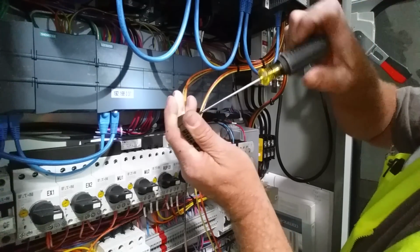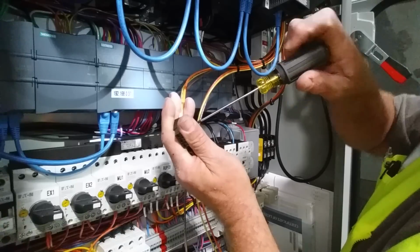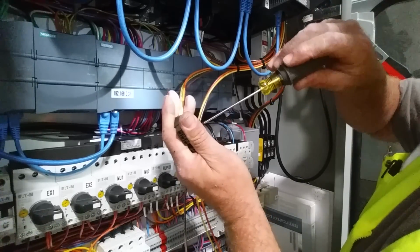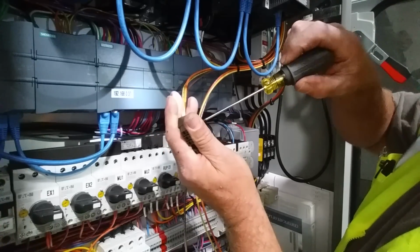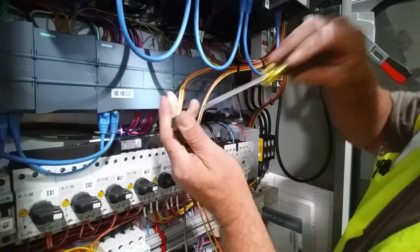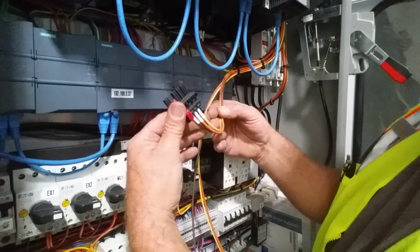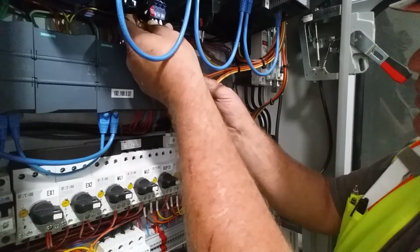And they got kind of a universal screw in there. It'll take a Posi driver or a flat. Posi driver is very different from a regular Phillips. That's kind of the European way of doing things, and these are German made drives. Alright, so we're tight there. Got our brown, orange, yellow on our plug, and at this point we just snap it into the VFD.